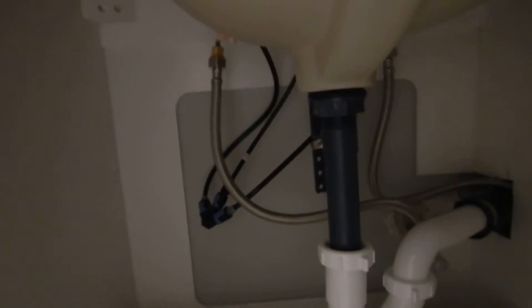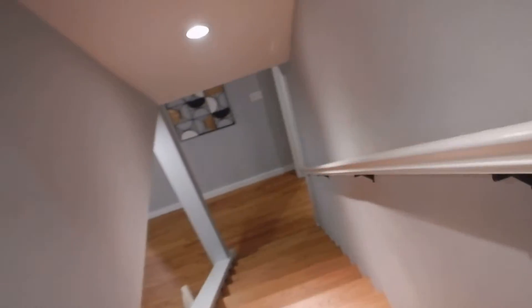It's pretty boring in here except we have a little tempering valve right there for this sink. But it's an isolated one — it's not for the whole plumbing system. Now we're missing our escutcheon plate from the plumbing that's coming through there. The plumbing is not properly supported in the crawl space. The plumbing is not properly insulated in the crawl space.